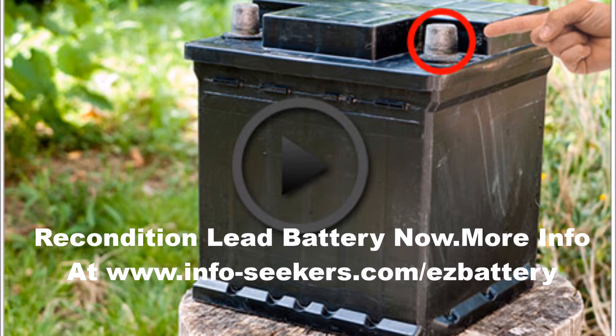Step 8: Gassing and bubbling of the electrolytes and other side effects will occur as a result of correct equalizing. Step 9: Take specific gravity readings and the true state of the battery's charge every hour during this process using a temperature compensating hydrometer. Step 10: Make sure you also replace any water that is lost in the equalizing process. Step 11: Check to see if the equalizing process has been completed — you will know when the specific gravity values are no longer increasing during the gassing stage. If the charger ends the process before the gravity readings are constant, restart the charger and continue until the gravity readings are constant.